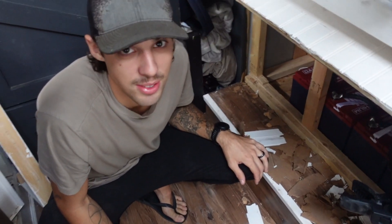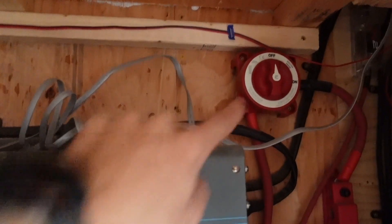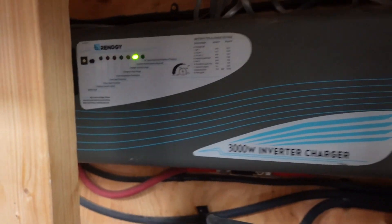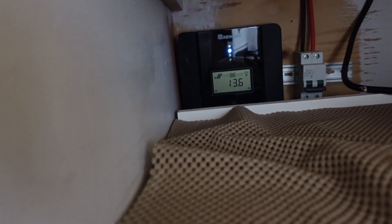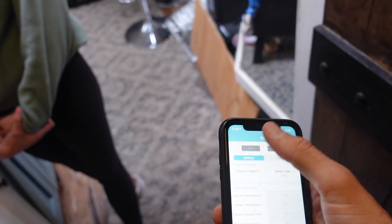Alright, let's see if it works. It's done — I've connected everything up. I've changed all the charging profiles on our inverter, our charge controller, and our DC to DC charger, so the whole system should be configured and ready to go. Now I'm going to turn it on. You hear that? That is the sound of power — the inverter clicked on, and the fridge is on. You can cross brand with a Renogy charge controller. I'll put it on the app and see what the app says — I need to go into settings and read the batteries.